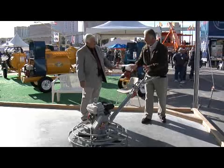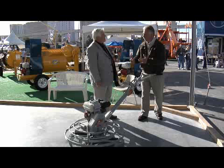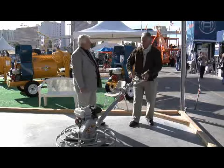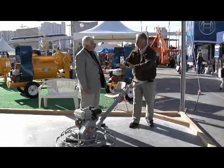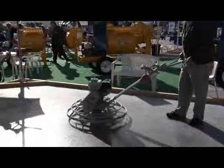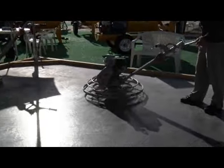The nice part is there's no way to disable this. Competitive units have some type of inertia switch or electronic switch that kills the machine if it gets away from the operator — but contractors can actually disengage that, which makes the machine very unsafe. On ours, we guarantee that if it gets away from the operator, with just one revolution from the inertia of the swing it'll kick out the Dyna clutch, yet the engine remains running. The operator can come right back, kick the clutch back in, and he's right back to finishing. For liability purposes, and for operator comfort and safety, that's very tough to beat.